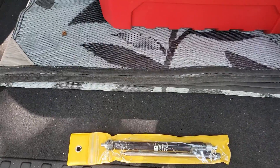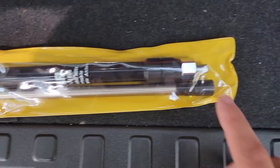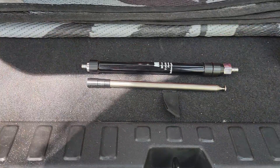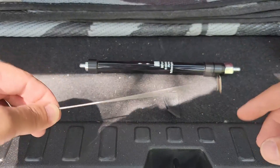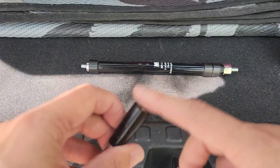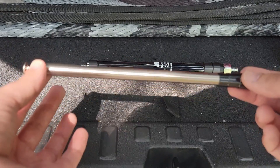This is at the Melrose. Right now I've got a new antenna to try out. I have the MFJ1898. This is very similar to another antenna that we reviewed on the channel here recently, except that it uses a 3/8-24 mount. Now that we have this thing out of the bag, there are two main pieces. This whip is somewhere between six and a half and seven foot long, and it's a fairly delicate whip at the outer extremities. With the proper adapters, you could use this seven-foot whip all by itself and get on whatever band you think you might be able to get on with a six to seven foot long antenna.